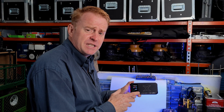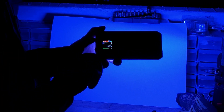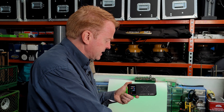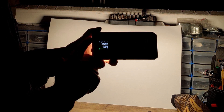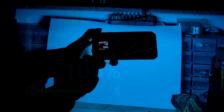The next mode is gels mode — there are 150 options. What's really handy: if you're doing a small chroma key setup and you don't have a green screen or blue screen, gels one and two are chroma key blue and chroma key green. Now in white light mode you can select a CCT, and when you go back to gels mode, that selected CCT becomes the base CCT that the gels are applied to.